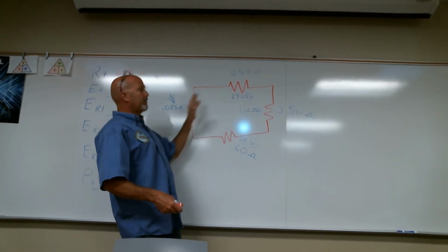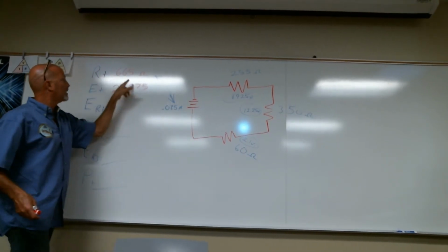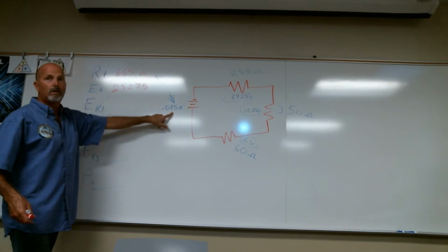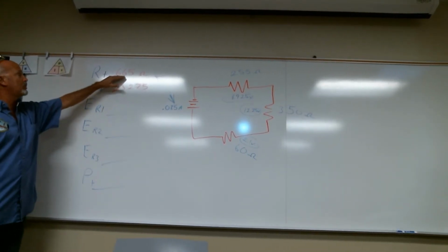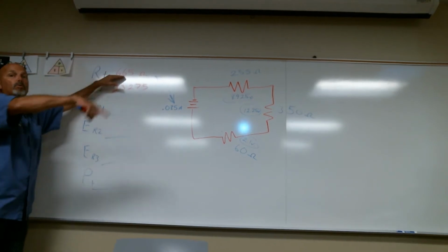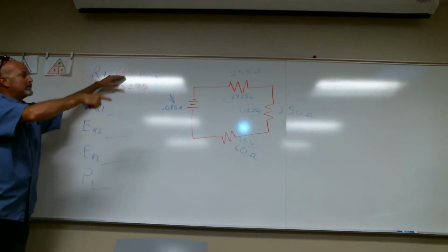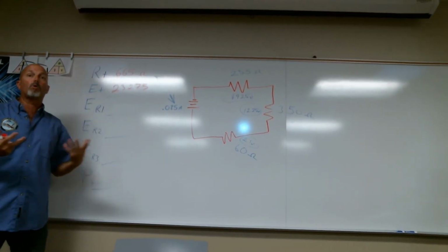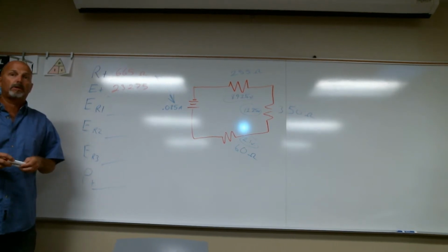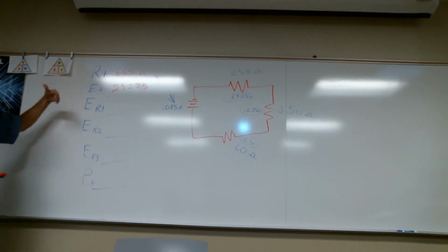Yeah, so you just added the resistance up there, 665, and then you took that times your 0.035 amps. Yeah, it's your current. And that gave me, since this is the resistance total, this is all the resistors combined. So with all the resistance combined times the current, that gave me the total voltage. So amps and current are the same thing. So, yeah, current is amps.